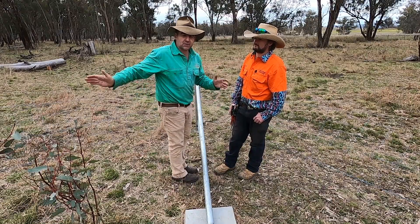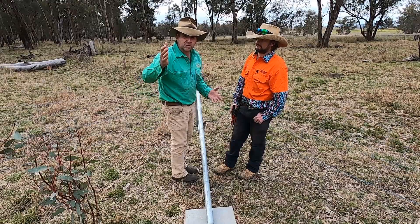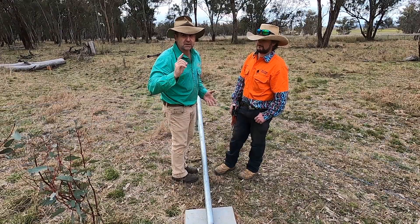So if you are tempted to run your stays down the fence line because you've got small paddocks or you're in high traffic areas, consider a longer stay, because what you're going to be doing is compromising your stay if you maintain the same length.